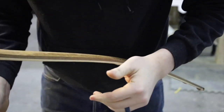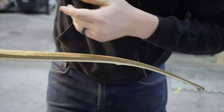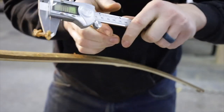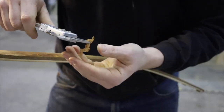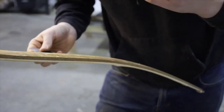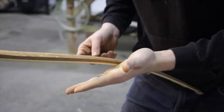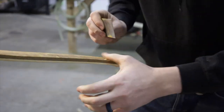And then technically the two ways to do this is if you can see how far off you are, with one of your shavings, you can actually measure it with the calipers and get your reading. And then from there, you can know how many scrapes you'll approximately need to get that much wood off. If you like going technical, you can do that. And so for me, it's about 4/1000ths of an inch, 4 thou basically, or 5 thou. And so I can know that if I need to get, let's say, 1/10 of an inch off or 100 thou, I need to do 20 scrapes to get that off. That is technical, but if you like that sort of thing, it can be helpful to be precise.